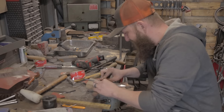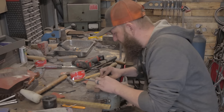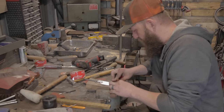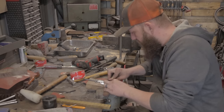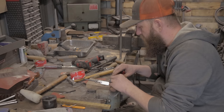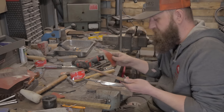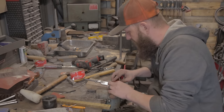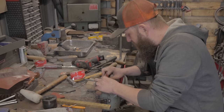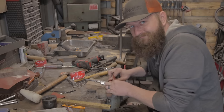And when you hand sand a blade, it just has a finish that can't be described unless you've done it. The first sword that I ever hand sanded was actually my Gladius the first year I went to Blade Show. I took it up to like a 2000 grit on the machines, on the big Bader sanders. I took it way up in grit. But when I took it back down to say like an 800 and 1200 by hand, it was so much nicer. I can't even explain to you how much more handmade it felt. It took it from a mechanical piece to a very organic, handmade finish. So no matter what I used to think about waterfall platens, they most certainly are not a cheat, and you still have a ton of hand sanding to do.